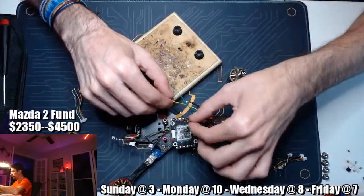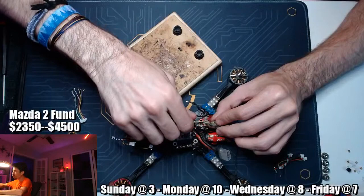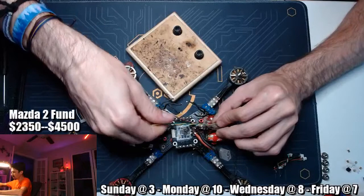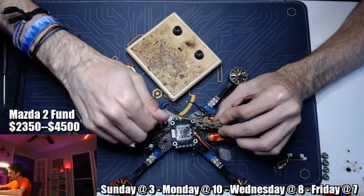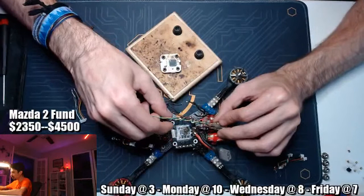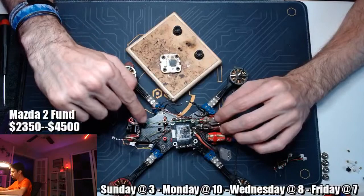I am going to twist these RX and TXs, but much more lightly than the 5-volt and ground, because I don't want to shorten them up. I just want them to be together. I just want them to be friends, so that one of these cables doesn't go rogue and try to sneak out the side into the propellers. So yellow is on the outside, and what that means is that yellow is going to be the farthest forward, which is kind of annoying because the yellow wire is a little bit shorter here. But we're going to be okay. We've got enough cable length to get this done. So yeah, I'm just going to leave them twisted up that much. That's kind of a light amount of twisting.